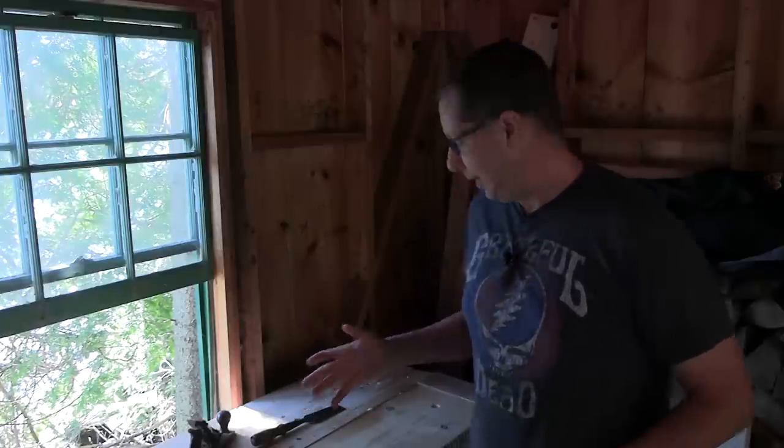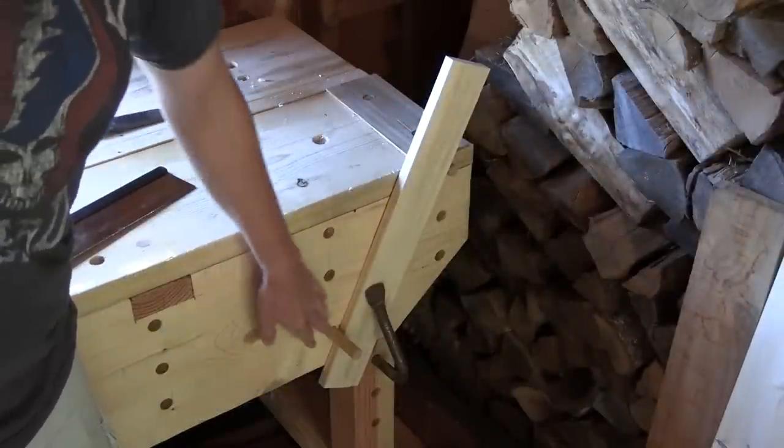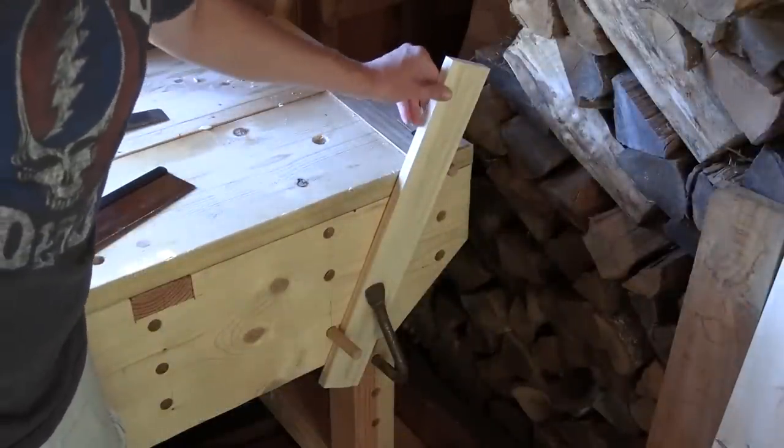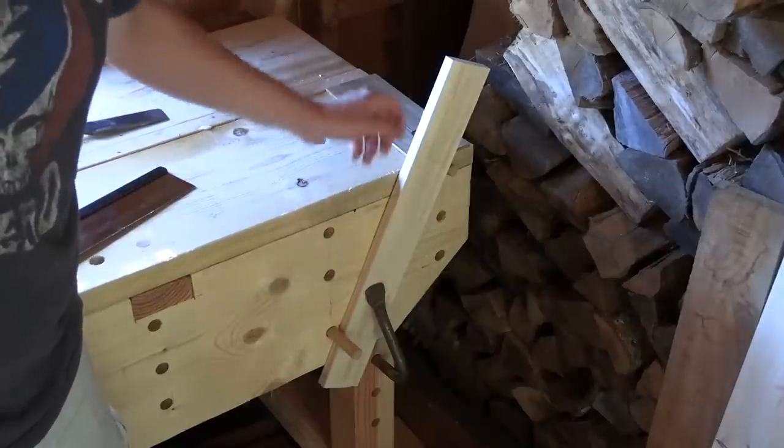And when you step away from face planing, you start to think, oh, I'm really going to need some vises. And certainly when I move into things like sawing tenons or resawing, I use my leg vise a lot at home. But working on this bench, I actually discovered the benefit again of working against a passive stop and just how powerful that can be. Here I've got the same peg that I was edge planing into. I put another peg down here in the apron and essentially wedged the board between them. And then the holdfast is just holding it up against the bench.